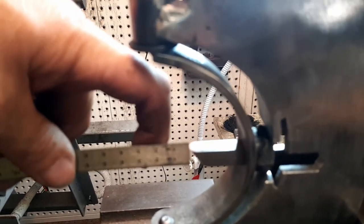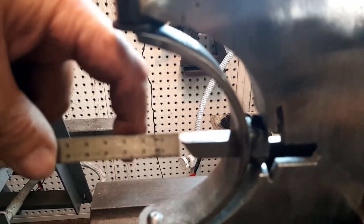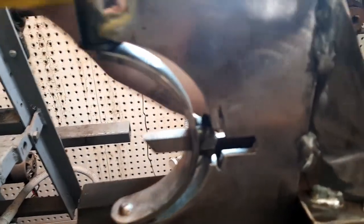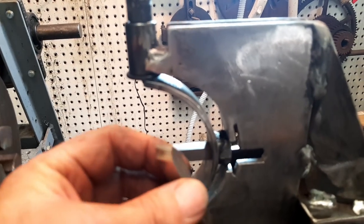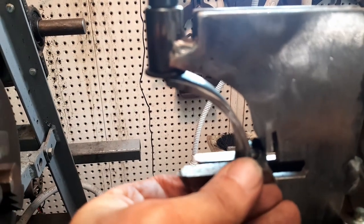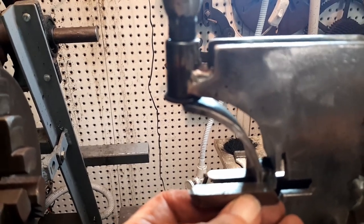If it was to be smaller than that, so 20 mil means double it for the whole diameter is 40 mil. So if I wanted even smaller again, I could just put a longer piece of tooling in there and you'd nearly get right down to 10 mil. That one's sort of ground. I just ground it before. So I can get an extra little bit there if need be. I could probably go from an 80 mil down to a 10 mil sphere. Not that you'd want to do one that small. Like, what do you need knobs for? There's knobs everywhere. So anyway,